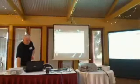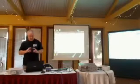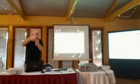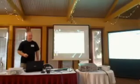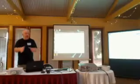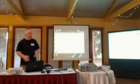Yeah. Sorry. When you talk about a universe, is that 512 channels? Or is it 512 total? This one says universe 2 on top, the bottom one says universe 1. Universe 1 at the bottom, universe 2 at the top. It's the physical connection. And up to 512 channels. Each universe is up to 512. I'm saying up to for a very simple reason. Because you can go out and buy hardware controllers that only have 194 channels, or 300 channels, and they're on the universe. But they only have 194 channels there. But normally, in terms of what we do, it's 512 per universe. That's what we do.